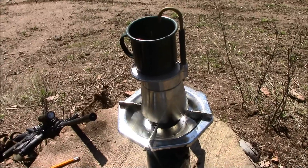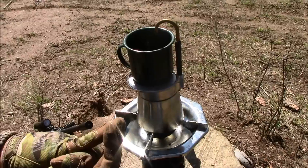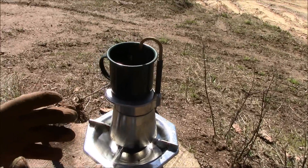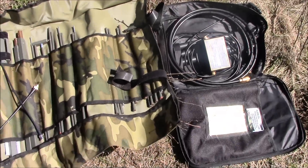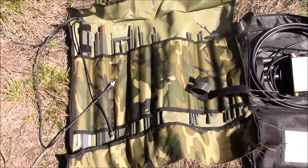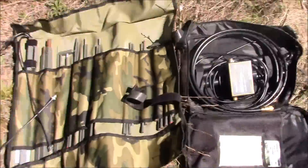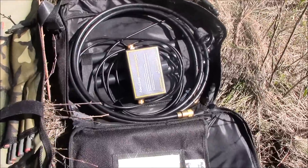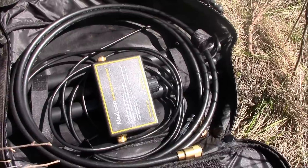So we can do comms. We're going to set up the KX3 with the Magloop antenna, and I'll even set up the pan adapter — that was something added on later to the KX3. We'll see if we can make some contacts, even digitally. It's just a quick field comms exercise. There are two antennas we're going to set up because I have the two meter module for the KX3 — the Arrow directional antenna on two meters, and the Magloop. This is an Alex Loop, good from 7 to 30 megahertz with an internal tuner, so I'll have to disable the tuner in the KX3.